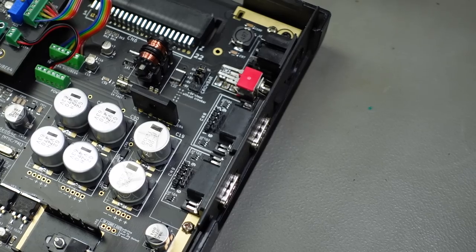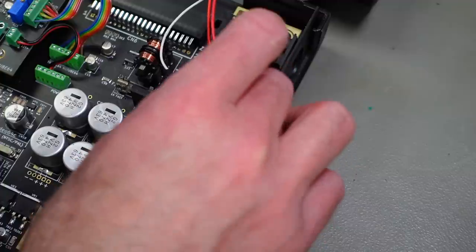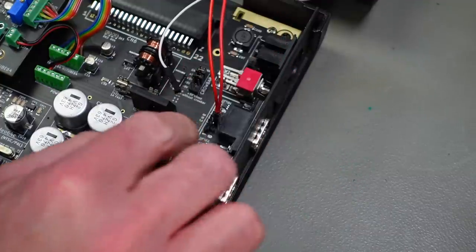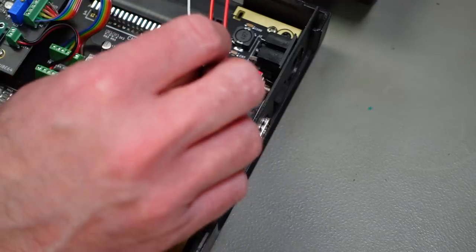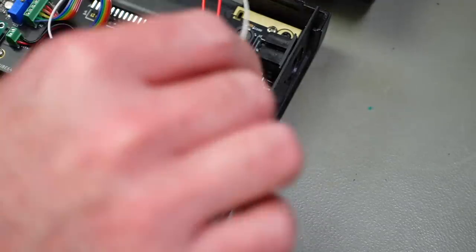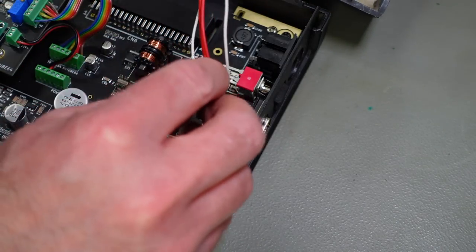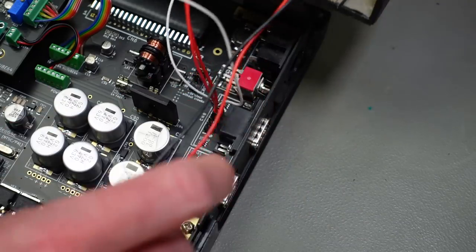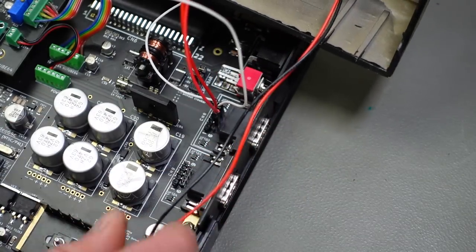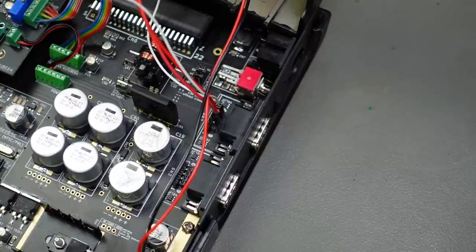Thankfully, our pins are numbered. We are using port 2, which is the one that's more backwards. So that should be pin 7 for the plus 5 volts. And then we have pin 9. And we should have pin 5, which is this one. And then we, of course, need to plug the LED back in, which is the shortest cable of them all. Don't know what I was thinking when I made that.